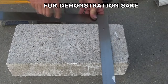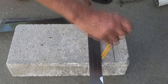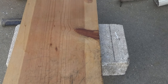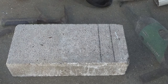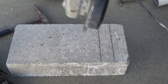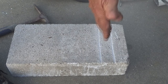For demonstration, let's say you wanted to put a piece of conduit through a piece of concrete about this thick. You can get a big board, clamp it down, and use a saw so you don't make any mistakes — go even with the board. You can use a bigger saw of course, but I usually follow the board and score it a little bit like this.